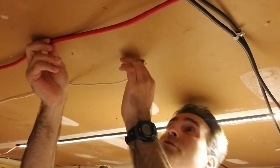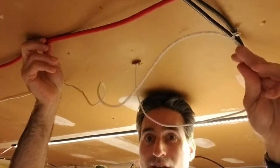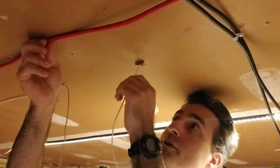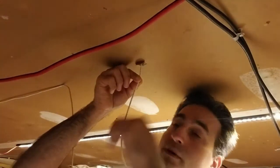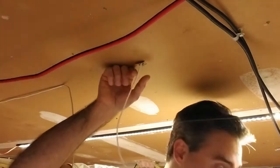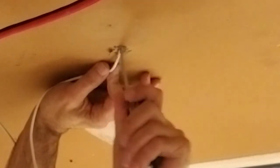First thing I want to do is check this. One thing I noticed is whoever installed this alarm left some extra slack, and I'd be worried about catching it if I'm going to drill through the floor in the closet. So I want to make sure it wasn't folded up in there — and sure enough, it was. That would have been bad to catch that and have it wrap around the drill bit and get destroyed. So if this is snug, I know it should be coming straight down, so when I go to drill through the floor I'm not going to catch it by accident. I'll go real easy and use a knife to open this hole up a little bit. Just remember the ethernet cable is an RJ45 — it's a little bit wider. If you're running fresh cable, you only have to open up to the diameter of the cable. I don't plan on re-terminating it, so I have to open it wide enough to fit that connector.